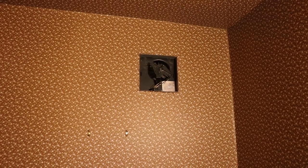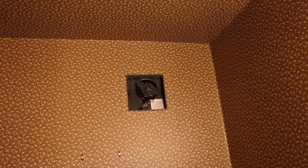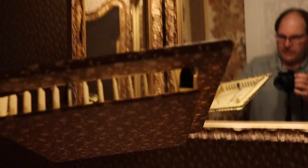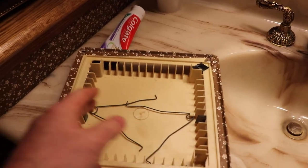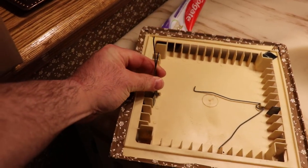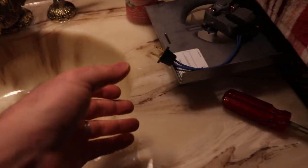In this video we're going to look at replacing a Broan F675 motor plate with a fan. I've already taken off the decorative cover and I'm going to replace this — I just have to take it in store and measure it against some other ones. To remove the fan plate you just pull it out, then pinch these and you can separate it from the fan.